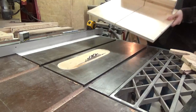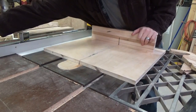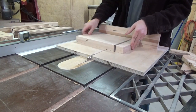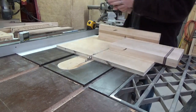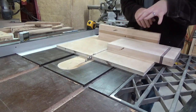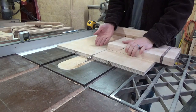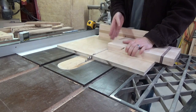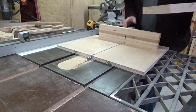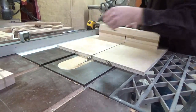I have a crosscut sled, like so. If I was cutting thin strips off of something like this, that would work just fine, because I can hold on to the material, I can clamp the material down, and then I can push it through safely. With a stop block, I can get very consistent thin strips. But that's not always the case — you don't always have a big block of material where you can do that.